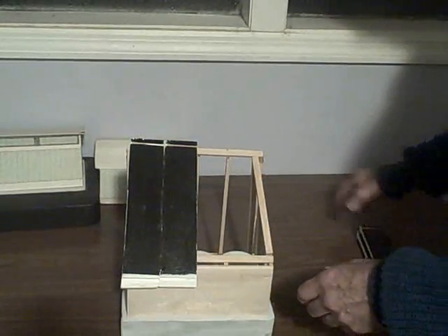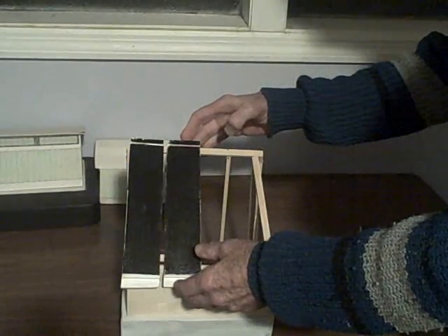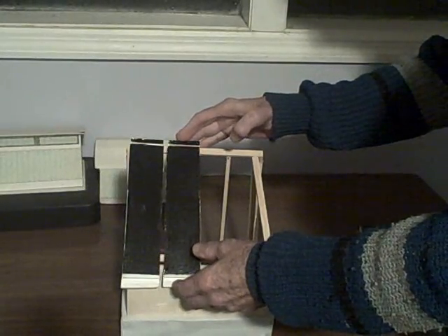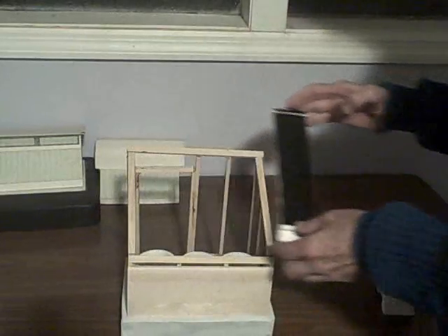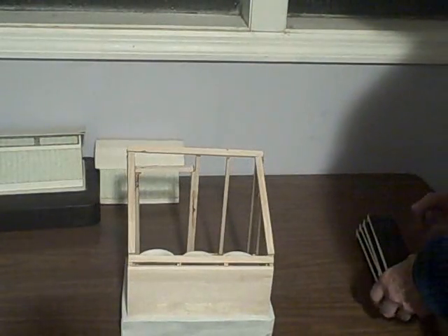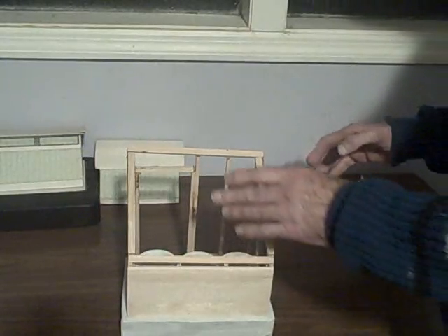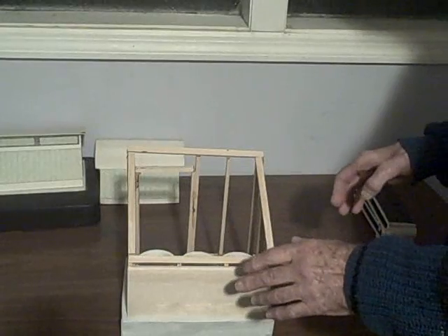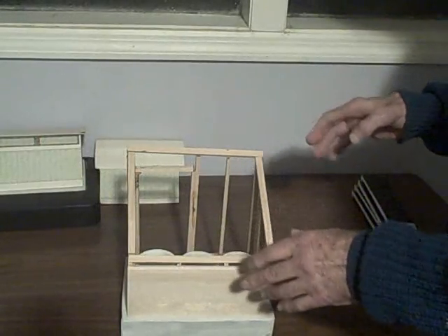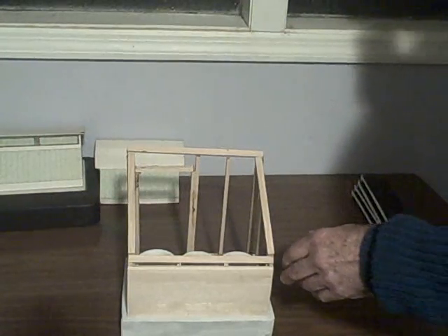The collectors are actually put on the top and they form the roof. You can do this with MTD collectors. If you were using other kinds of collectors, you would sheathe the roof with plywood or something to have a surface for mounting the collectors, but it's not necessary with MTD collectors.